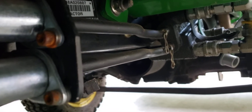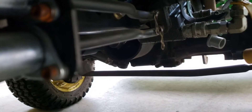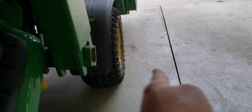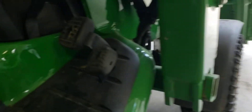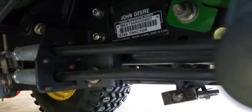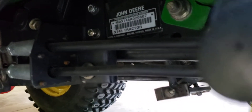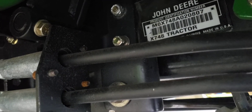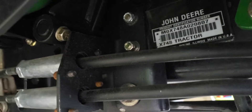Those silver pieces are where you connect your push-pull rods to your two-spool valve on the side of the tractor. You are going to have to shim the two-spool valve out from the tractor frame about three-quarters of an inch. Once you have that shimmed out, you can put some connecting rods on there. Those two bolts just to the left of my serial tag are what bolt the bracket to the frame that holds those two silver pieces.